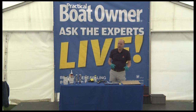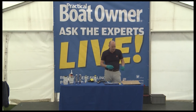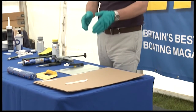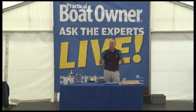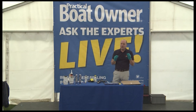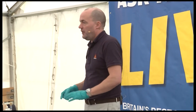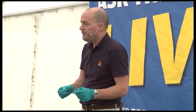With our adhesive when it comes to bonding, they work on their flexibility — that's how they get their strength and performance. It's absolutely no good pushing the two substrates all the way down and squeezing all the adhesive out, because you've lost the key to its performance which is its flexibility. So if you are bonding two substrates together, it's always better to put spacers in to ensure you don't squeeze it all out. A rubber spacer is ideal — or people have actually gunned out some Sikaflex, let it cure, cut it to the thickness they want, and used that cured Sikaflex as a spacer. That's an ideal way of doing it.